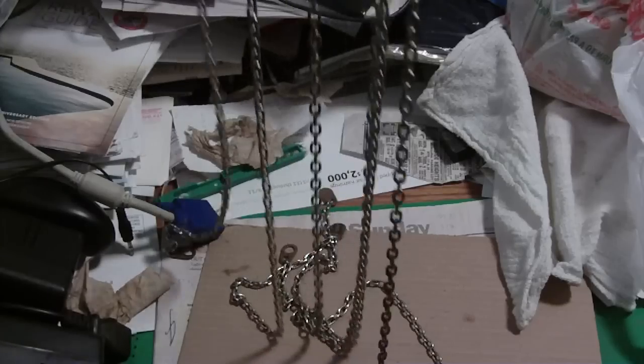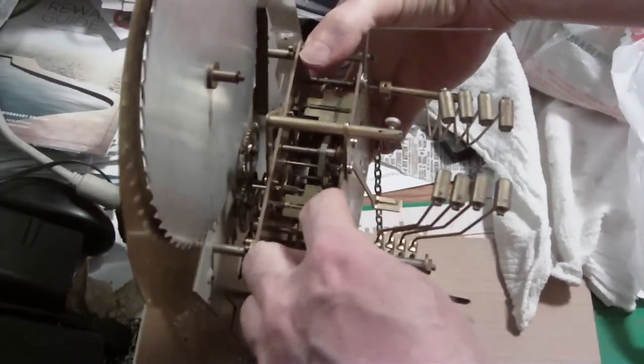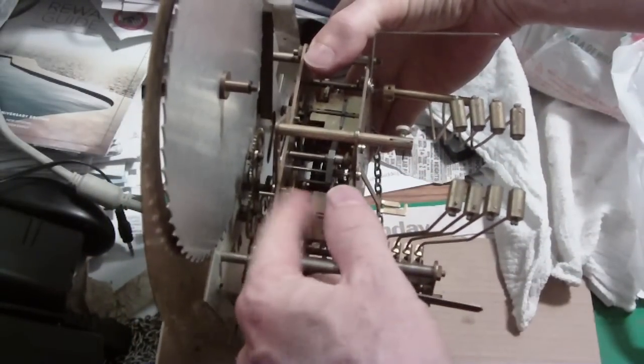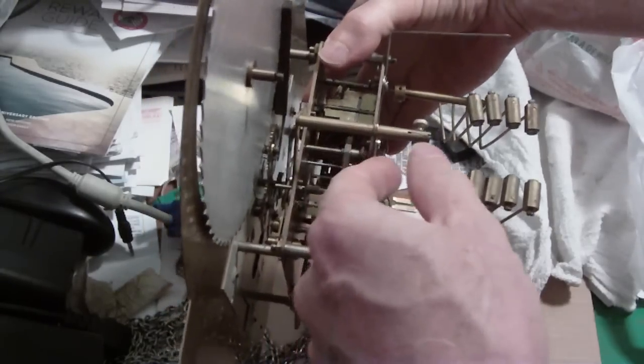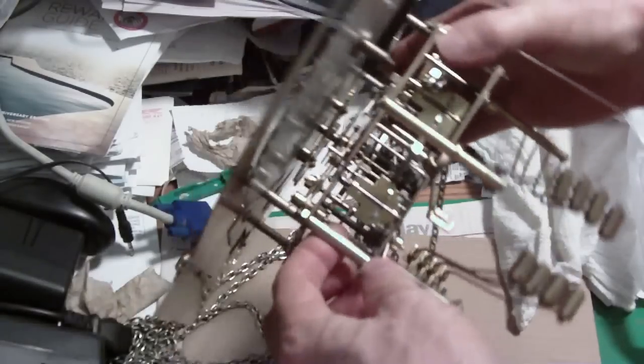And then you have to take the chains out. Then I got the wooden frame. I'm putting it behind me. And there's the clock. Oh yeah, one of these pivots I bent, on these things that control the speed for the chimes. I bent that, and I bent something else. I think it was the escape wheel. I bent the pivot on that because if you want to take one of these things apart and put it back together, you're asking for problems